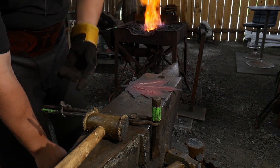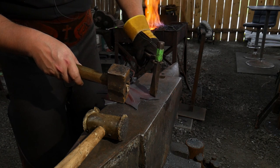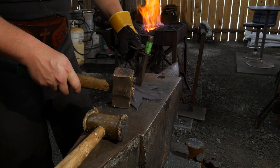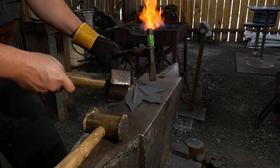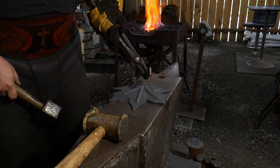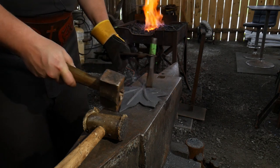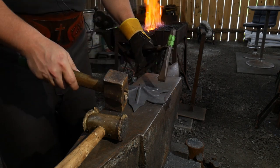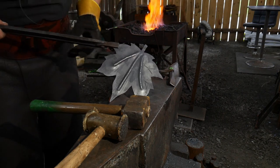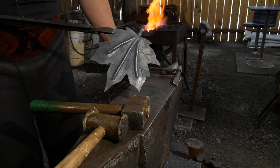Now I'm ready to add in some secondary lines, and you can do this however you like. I do suggest that when you put in secondary lines you don't try to bite onto the tall rib if you already have one — don't add extra lines in that direction, keep it out away from there if you can. I also like to do chisel lines the full width of the chisel. Make your chisel lines that full width versus making the mistake of doing a half chisel mark. Half chisel marks don't branch very nicely and you create the opportunity to double jump. If you make each cut of the chisel the full length of the chisel, it makes for a very clean aesthetic.